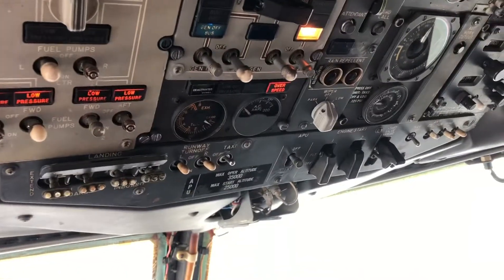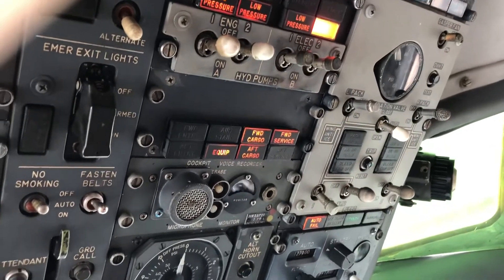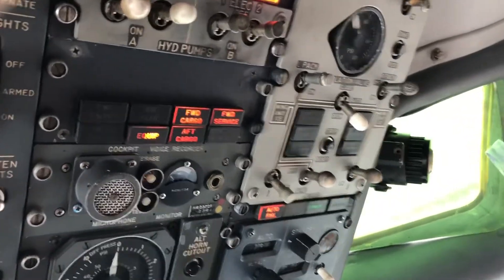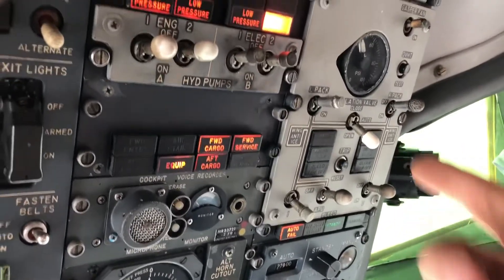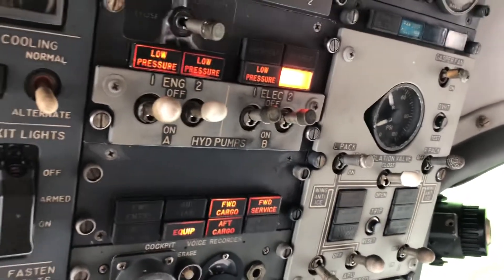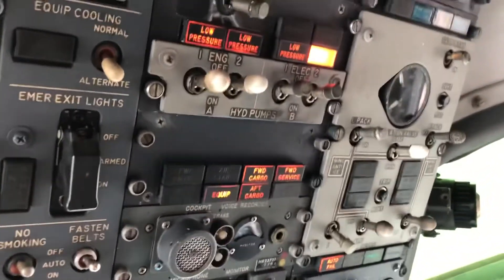Now to repeat this process on engine 1, there are a couple more steps we have to take. First is to close our bleed valve on engine 2 and open it on 1. Since our pneumatic ground cart is connected on the right side of our system and we have an isolation valve in the middle, we need to make sure that that's open so we're supplying air to both sides. We already are, but just to show you — if I close our isolation valve, after a couple seconds you can see we have two needles on our pneumatic pressure gauge: one for the left side of the system and the other for the right side. So we'll go ahead and open that back up.